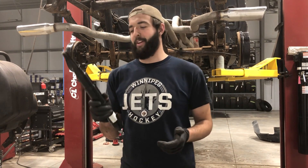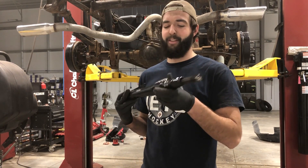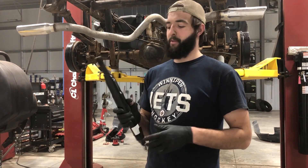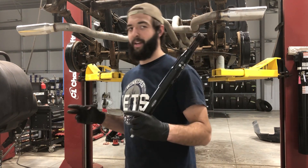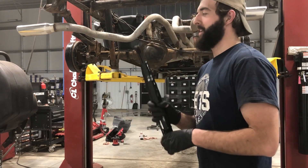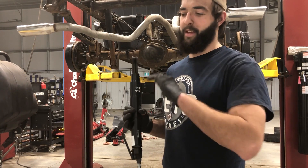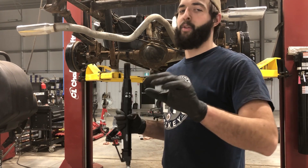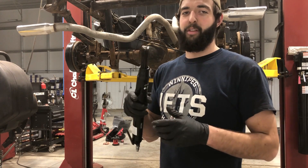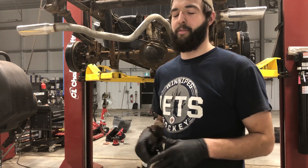I'll spare you the time lapse. That's a wrap — this thing works freaking awesome. Literally worth more than twice as much as that other one, but just worth every penny for sure. Pick one up if you want one — I got this from Princess Auto in Winnipeg, and you can probably get one online. It's a Pro Point one. Definitely worth doing. I wouldn't pick the wire wheel over it or the other. You definitely need both. The wire wheel works best ripping around in big areas, but in those nooks and crannies or where there's really heavy built-up scale, the needle scaler is perfect for that.